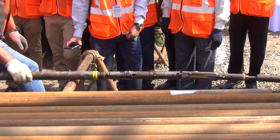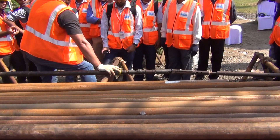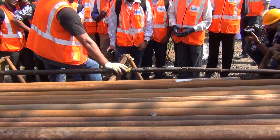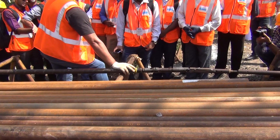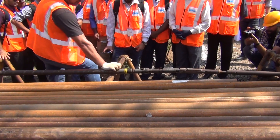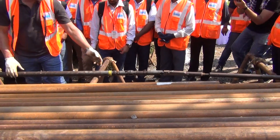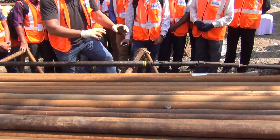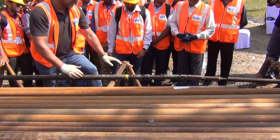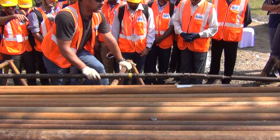This is your normal head assembly. You've got two rubbers there. Once the barrel is completely filled, it pushes and gets inflated, blocking the passage of water. So even when you're drilling and the core blocks off, these swell, stop the water going through, and on your gauge it blows off. You can get different types of rubbers — soft and hard. Normally guys just use hard rubbers.